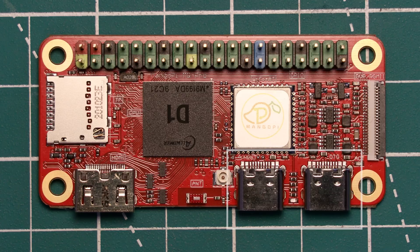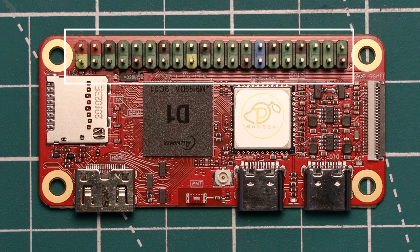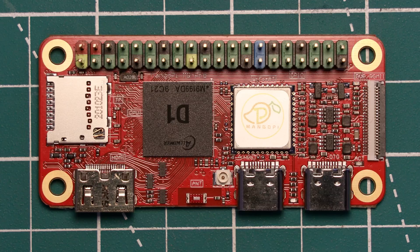There are two USB ports: one host connector and one OTG (on-the-go) connector. There is a 40-pin GPIO header, which is the same as the Raspberry Pi header pins. Mine came pre-soldered, but the newer boards appear to ship with unsoldered headers based on the product page photos. You can power this board via the USB-C connectors or via the 5V pins on the GPIO headers.